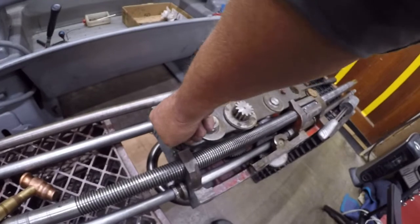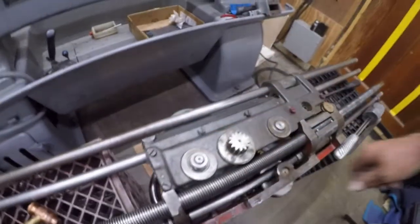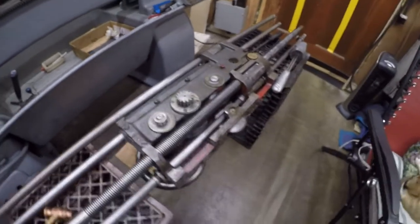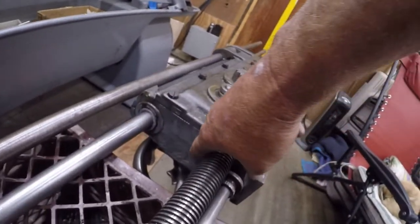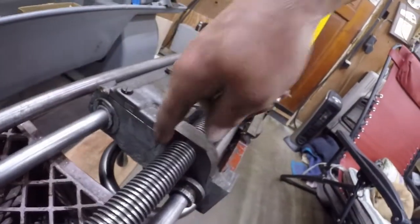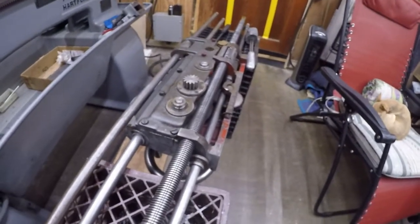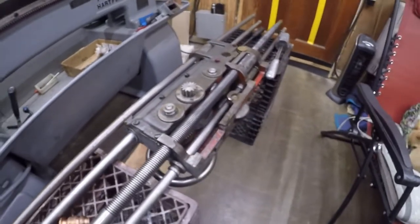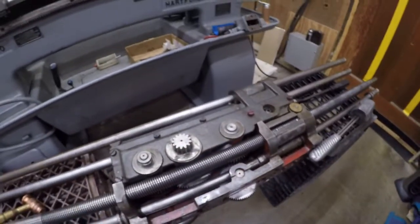I don't know how serendipitous it was that I happened to pick up some brazing rods, but we got a crack here. So I'm thinking I should drill a hole at the end of it, V it out, and put some bronze in there. All I have is map gas. That may be a project for the future.